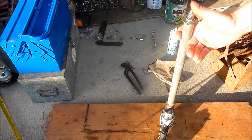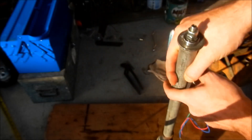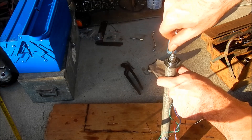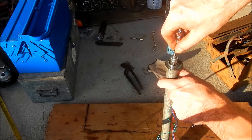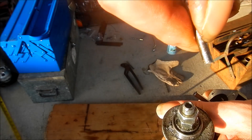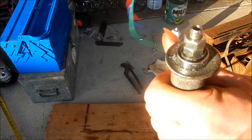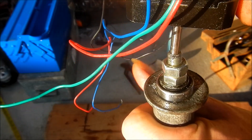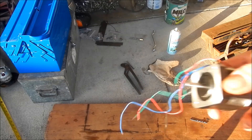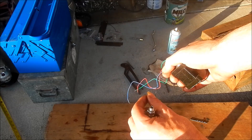OK, back again. I've been drilling away now for probably 40-odd minutes and I did stop for a bit. You can see I've made quite some progress. I'll put that drill bit in for a guide — you can see it's quite wobbly, because you do end up making a hole bigger than the drill bit. I've got a good 13 to 14 millimetres in there, and it's actually still just a little bit too small for my stepper motor shaft, so that's perfect. It is really centred and it's been going quite well. I've been keeping the lubricant up — at no point have I been able to take the drill out and burn myself; it's never been hot enough. If you can burn yourself with the end of your drill bit, you're drilling too hard and too hot.